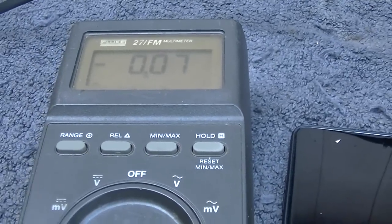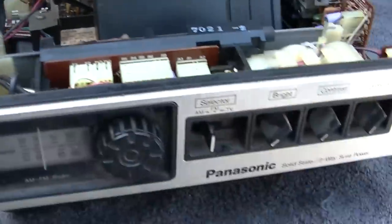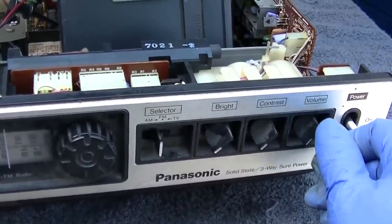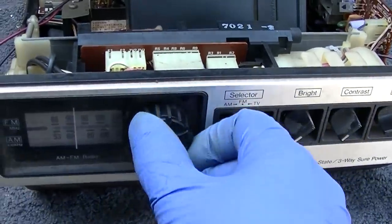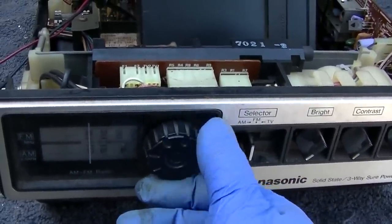So is that really what we have, is 70 milliamps right now? I mean, maybe the batteries are what blew the fuse. You know, maybe the batteries are shorted and someone plugged it in and it tried to charge shorted batteries. There's channel 6.